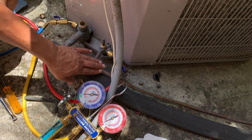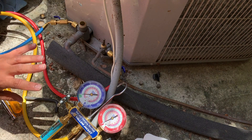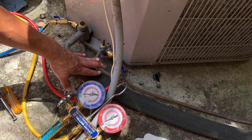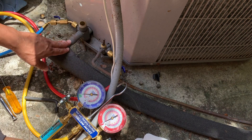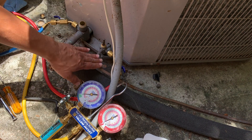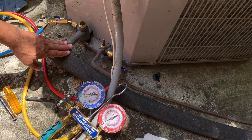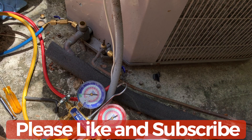There's still a small amount of refrigerant left in the line — you're not supposed to release that into the atmosphere, so I'm going to use my recovery machine to recover whatever is left. You can recover the entire refrigerant if you want, but it takes longer. It's better to trap it in the compressor and recover the little that remains. Then I'll run a vacuum test on this line to see where the leak is. That's how you pump down and recover refrigerant. Hopefully you liked the video — please subscribe and like!